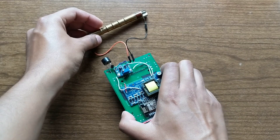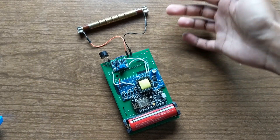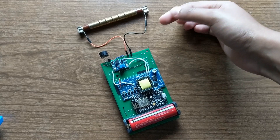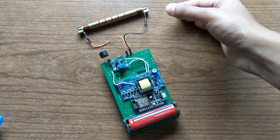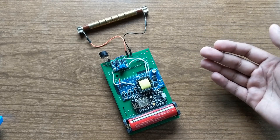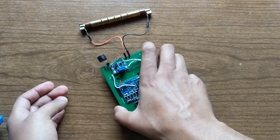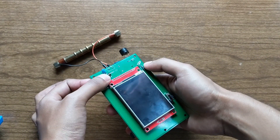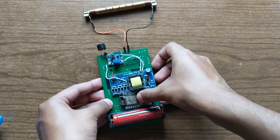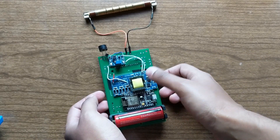The Geiger tube has 400 volts applied to it, and normally no current flows through it. But when ionizing radiation like a beta particle or gamma photon passes through it, it can ionize some of the gas molecules in there, and that results in a small pulse of current. It's actually a voltage spike at the negative side of the Geiger tube that's detected. There are resistors, capacitors, and a transistor to work with the signal and turn it into a clean square wave that's fed into the microcontroller, where it acts as an interrupt so the microcontroller can count the pulses, do calculations, and display it on the screen.